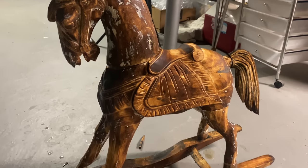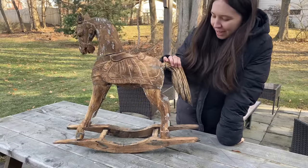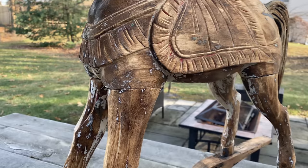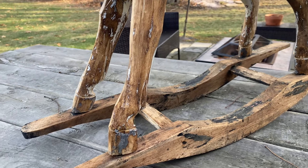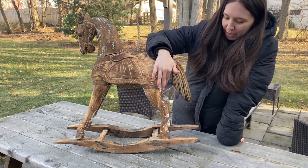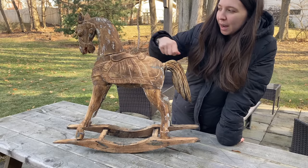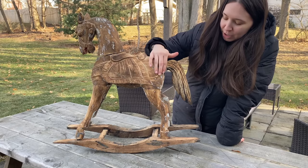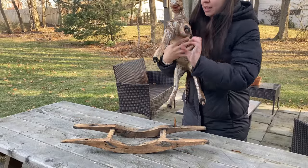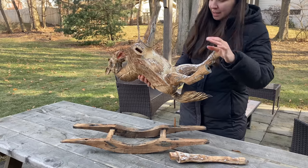The horse is very wet, so I just put it in the basement where it gets really hot so it could dry out nicely. The horse looks all stripped and I think it looks so much better. I'm going to give it a light sand with a finishing sandpaper. I still have to decide if I want to add one more layer to get the extra paint off, or if we like how it looks and leave it, or maybe even do a whitewash over it to add a little more dimension. This actually completely comes apart — the legs come off and everything — so I'm going to keep it apart for a bit to get into the spaces better.